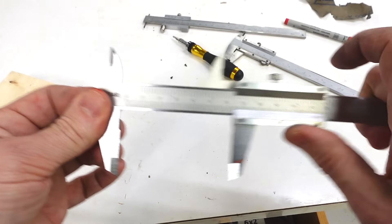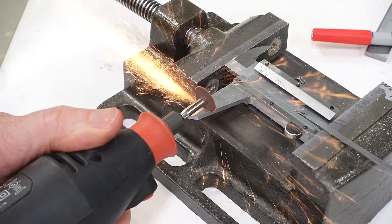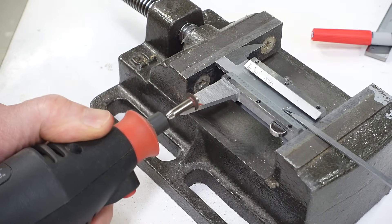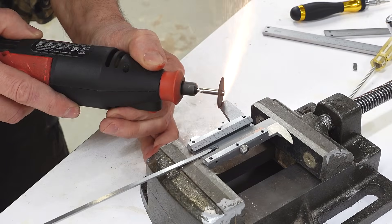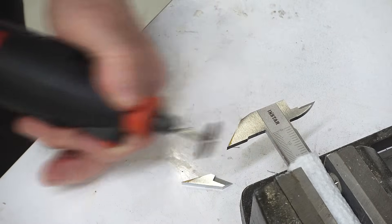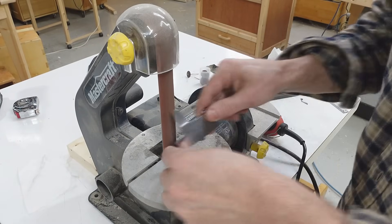Well, that slides a bit better now. I managed to fully use up that disc without breaking it. The key to not breaking Dremel cut-off discs is to have a very steady hand, and to help with that, never hold it freehand in the air — always have your hand resting on something so that if it binds a little bit it doesn't move out of control. Also, unclench the disc as soon as you're done cutting. I also rounded all the outside edges that aren't used for measuring, because it just so much improves how the calipers feel in the hand.